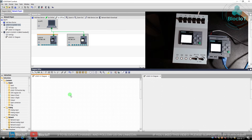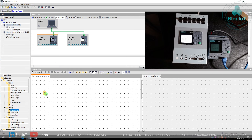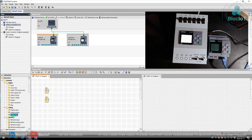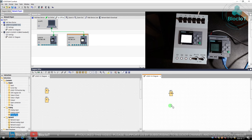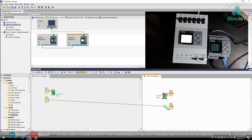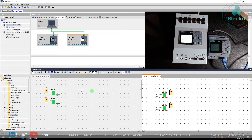At this point we are done with the configuration. All we need to do is ingest some data into those memory areas so we can see the result in the MQTT broker. We drag two analog inputs — AI1 and AI2 — and then use two analog flags, AM1 and AM2. We connect analog input 1 to AM1 and analog input 2 to AM2. As the last step, we download the program to each of the LOGOs.